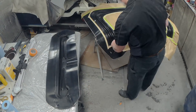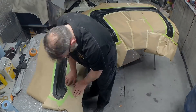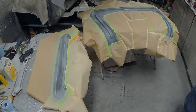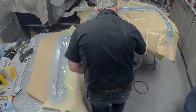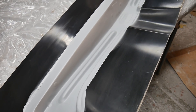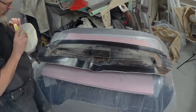Here's the quick version of how we actually get this done. You'll notice the beige tape going down — that's some old school masking tape I have in the shop. The first sign that I thought things were going to go well with the release was that the green masking tape would not stick — it just wouldn't hold. But the older beige stuff stuck in. So the top tip is: if you're having trouble with tape sticking, the part's probably going to come out of the mould well.